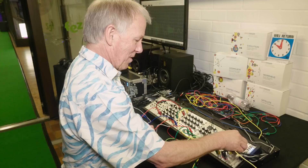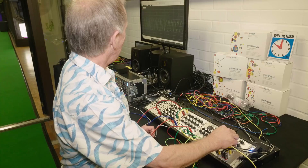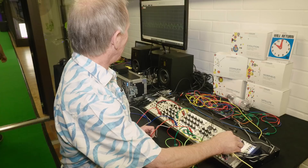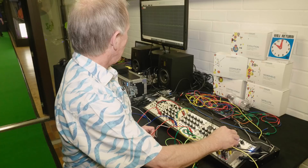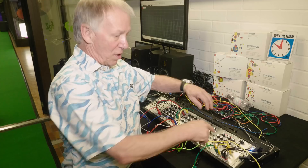I need a little bit more volume here. So there's the modulation index low. Instead, I take the modulating oscillator up to a higher frequency — got to find a sweet spot here. In addition to being able to use the internal modulation oscillator, we can put in an external source, such as another oscillator.